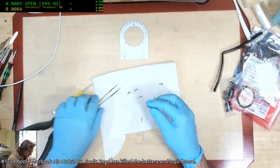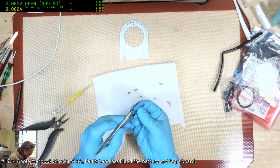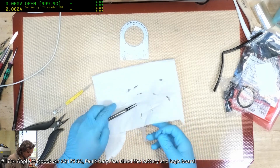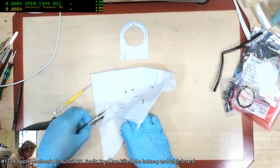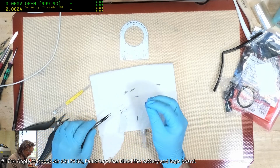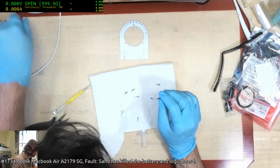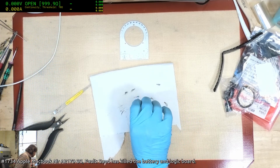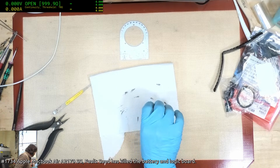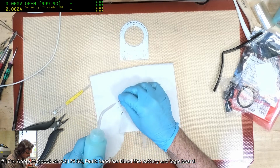Yeah, the glare can be a bit of a problem. It's hard to define what's causing the glare, and I find sometimes if I've got a lot of flux or any sort of reflective stuff on the board, it can appear glary, and the only real way you can solve that is to have even more light and then bring in the polarizer. I'm not sure how a polarizer would go because my LED lights are rotated in different ways, so it may actually be more of a problem than not.